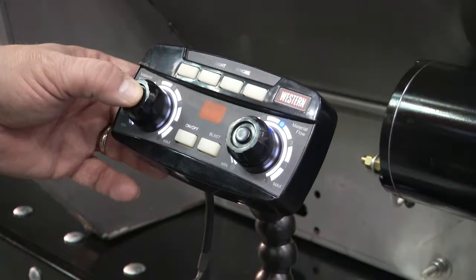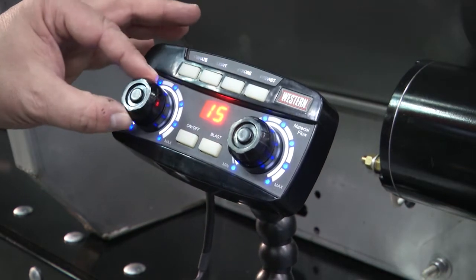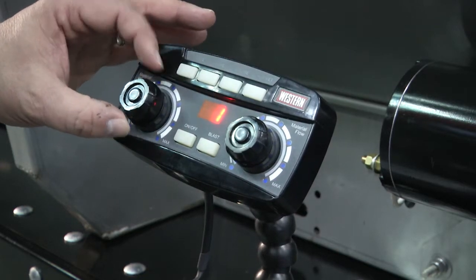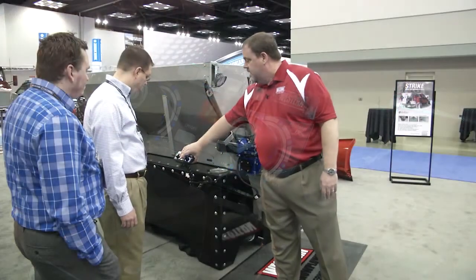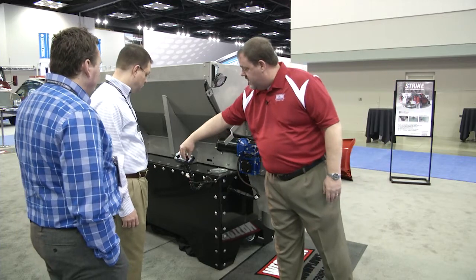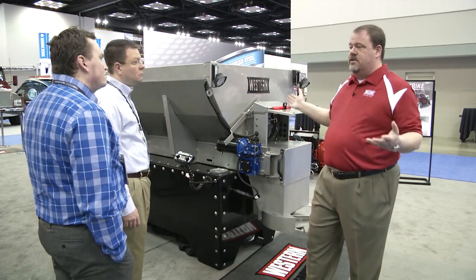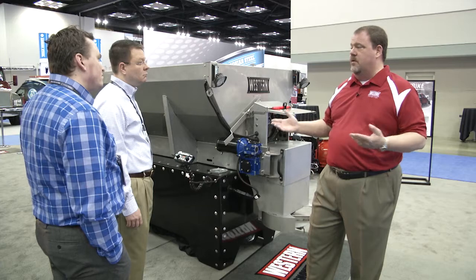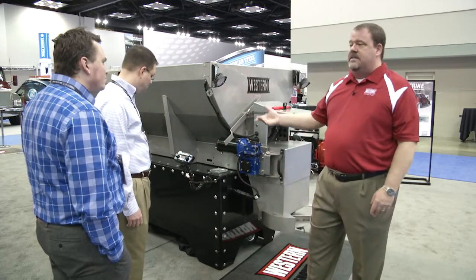We like this particular unit as well — it's got a nice backlit LED, you can make it good and bright. When it's on, you can tell what setting you've got it at. Say you have it on max and max and you're just blasting material out. The nice thing is that with the unit off, as you're driving from one site to another, you can actually adjust the settings. Say one's a big box store where you want to throw salt as far as possible, but then the next one's a supermarket with cars everywhere and you want to bring the pattern in. You do that, and when you get to the new site and turn it on, it's at the new setting.